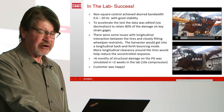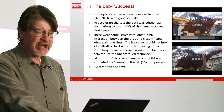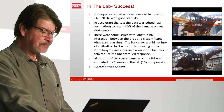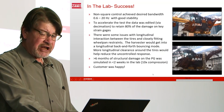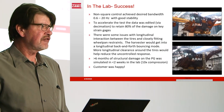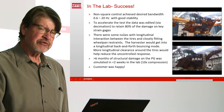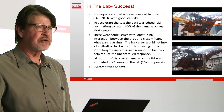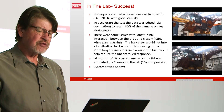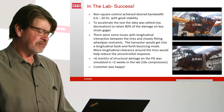There were some issues of longitudinal interaction between the tire fitting into tight-fitting wheel pans — I had wanted more clearance, which will be changed later — but we did get good results. We got a major failure after two weeks of running in the laboratory. We were a little concerned about that because the customer was coming in the next day, but when he came in and looked at the failure, he said that's the same failure they saw after six months of operation of the prototype in the field. We got it done in the same mode in two weeks — that's a 10-to-1 time compression and a significant savings for the customer, who was very pleased with the test.